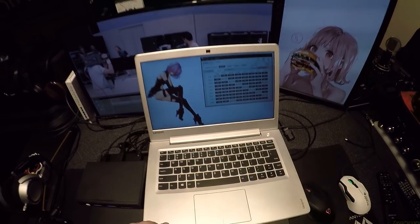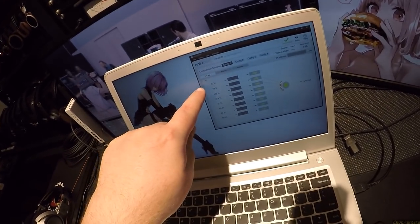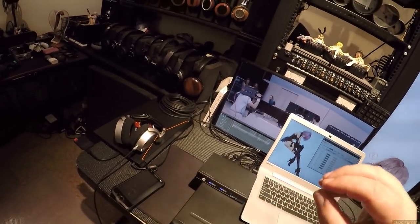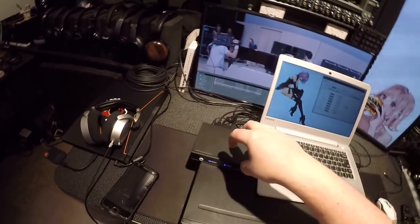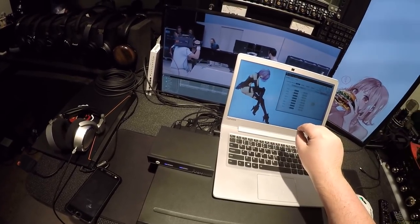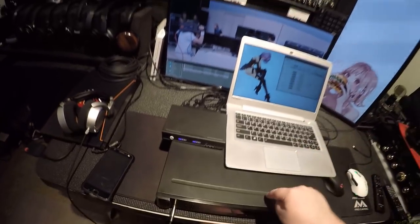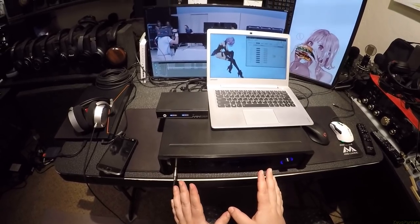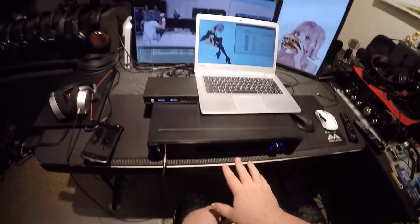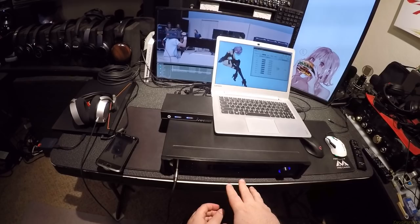There's LFE in here and at the bottom there's LFE management. If we go to LFE management, you see that chart which shows you all the channels — front left, front right, LFE, center, surround left, surround right back — and you can run a low pass filter. You can actually yank out the things going to your point-one sub manually per channel, adjust levels per channel, and send it out through HDMI to the receiver.